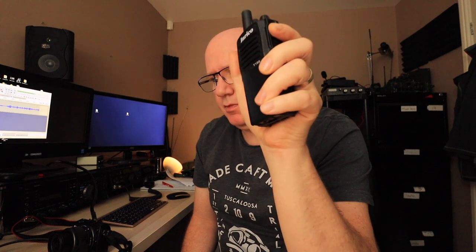I've dialled in 70.40 MHz because this only does 25kHz steps. I'm on 10 watts output so we should make the distance. Yeah okay, bear in mind my 4m aerial is inside, but we'll give it a go — I'll give you a call on 70.40. Yeah okay, and if you have difficulty hearing me I can go up to 50 watts. But we'll try 10 watts and see if we can make the distance.